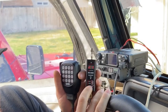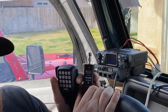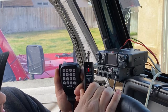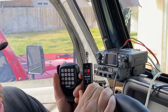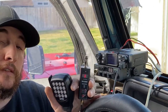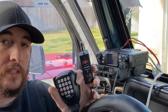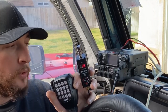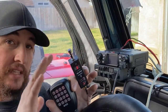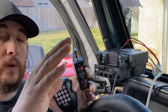Now I'll switch the meter to watts mode to see the radio's output power. Keying the mic, we're getting 3.9 watts on low power with a 5-watt dummy load — excellent. Now that we've verified the tester works with the dummy load, I'm confident connecting the actual antenna to the unit and checking SWR, testing the cabling all the way through to the antenna output.